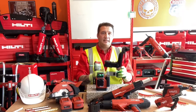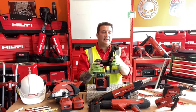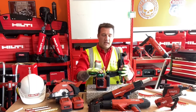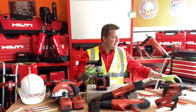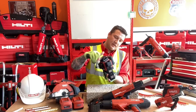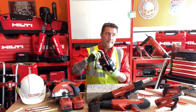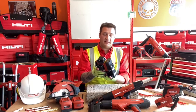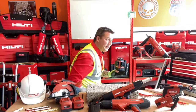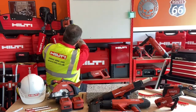So we offer the PRA30/PRA90 laser bracket. This is a great piece of kit — it's got a little attachment for lips, a screw attachment, a ballast, and you simply add the laser onto the magnetic part. This is a green beam laser and you'll be able to see it up to 40 meters with the naked eye, and up to 100 meters if you're using the PMA31G receiver. The magnetic end simply attaches to a steel beam or strut, making it a very easy application.